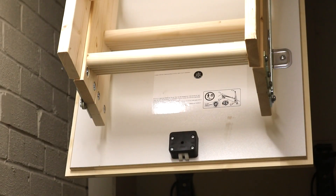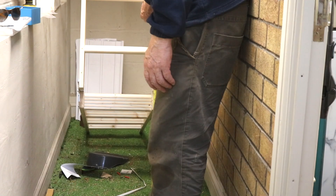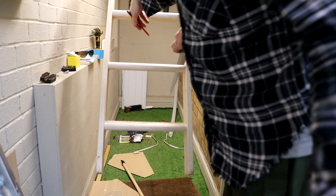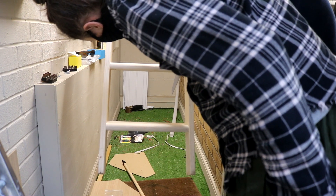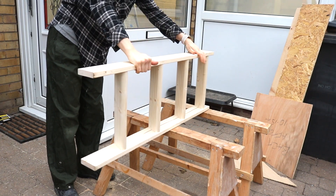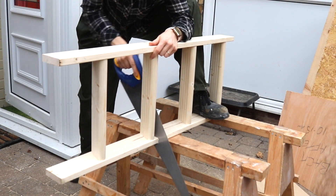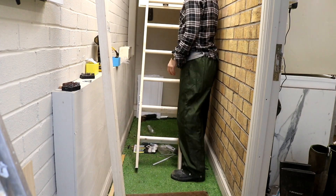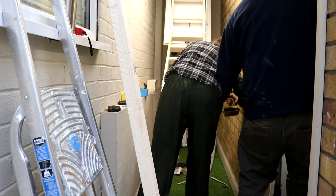Then we needed to cut the ladders down. We lowered them but had to angle the folded-up section towards the back and measured the gap between the floor and where the ladders folded — that was 21 inches. I transferred the measurement to the ladders. Couldn't find a square, so I drew a line using the back of a handsaw. I unscrewed the bottom ladders to take outside and cut them. Then screwed them back on again, checked to see if any more needed taking off, but it was flat to the ground and we were happy.